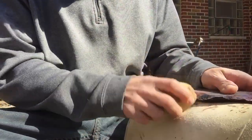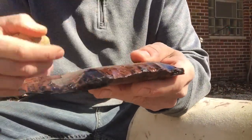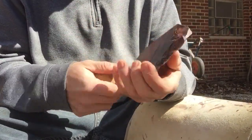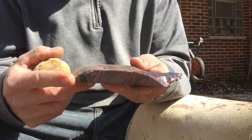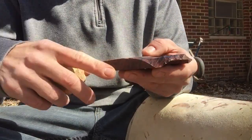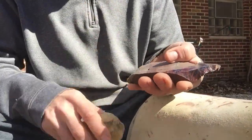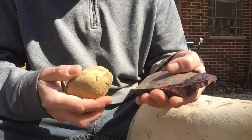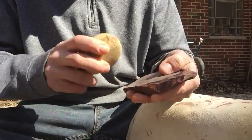If I was working on the ledge hitting, I'd risk overstrike, and I would have more troughs and valleys. This is keeping everything in a line and smooth. So that's ready to come back this way. Now let's follow suit on this square edge and work from both corners to turn this edge down. So support underneath, drop my angle. If I need to hit a harder area, I can find a little more pointed spot on the hammerstone.